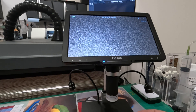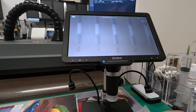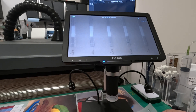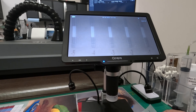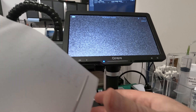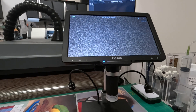This one is the right side — you can see it's off and it's in the negative, showing negative three. On the horizontal right distance, the current value is seven, so I'd set it to four, save those values, reprint an alignment, check it again. As you do that you'll see it getting closer to zero — you want zero to be the spot.